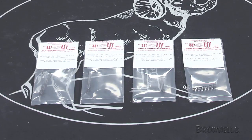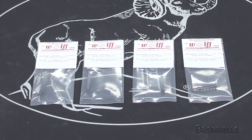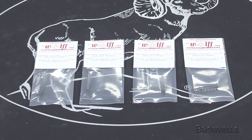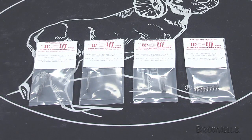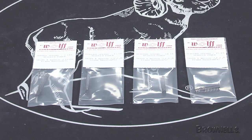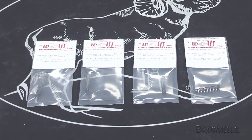The Pro Spring Kit for Smith & Wesson J-Frame Revolvers contains three different rated reduced power rebound springs, plus one reduced power hammer spring. Heavy factory springs inevitably result in a rough and heavy trigger pull. Carefully choosing the right spring pressure with the kit's 13, 14, or 15 pound rebound springs can improve the trigger without compromising function.